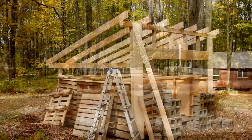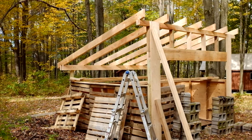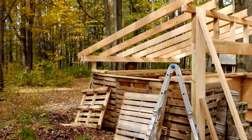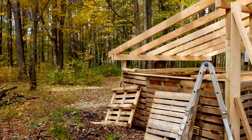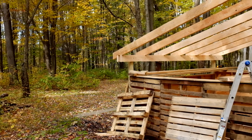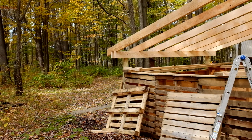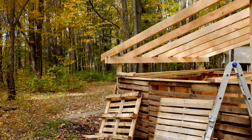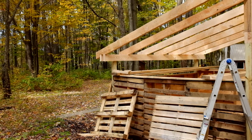Here's where we're going to leave it for today — we got that knee wall built on the front, and the beam on the back is just screwed into the side. Same as we did with the pole barn, underneath each one of those we'll put blocks to support it and keep the weight off the lag — just some two-by-four sections screwed in. The pole barn's been up for three or four years now with the same technique.